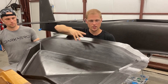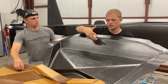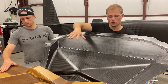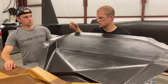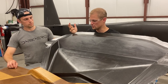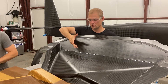You can see that the surface finish is not as pristine as the surface finish we have on a lot of our other carbon fiber components. That's because the mold dictates the surface finish on the part — the part picks up whatever we have on the mold. So because we used MDF, that's where we get this surface finish that's not quite to our normal standard. But we can accept that. This is a non-cosmetic part — it's hidden up in the wheel well of the aircraft, so no one's really going to be looking at it. Our MDF mold did produce a decent part.